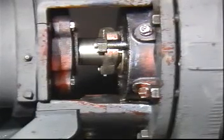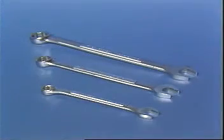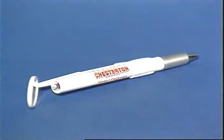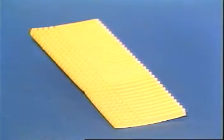To properly pack a rotating pump, the following tools will help make the task easier: appropriate wrenches, a vernier scale, inside-outside calipers, a mirror and a flashlight, a flexible ruler, and a flexible packing extractor.